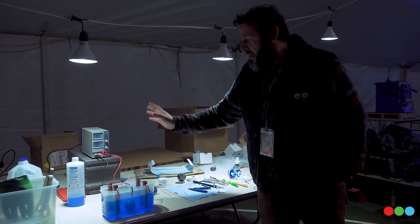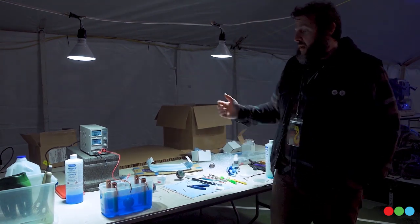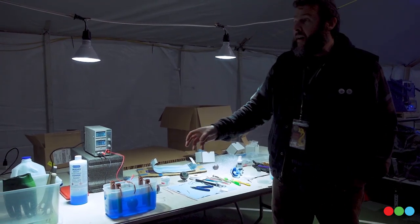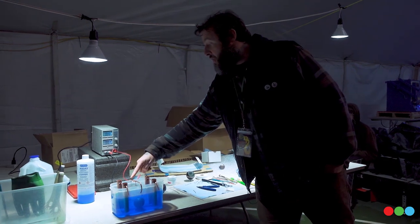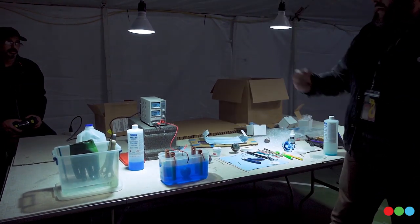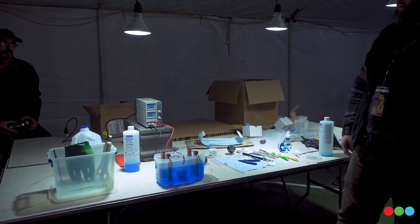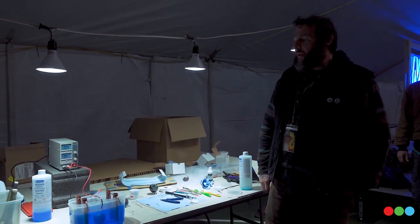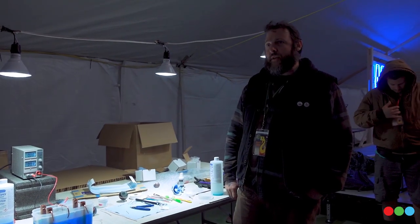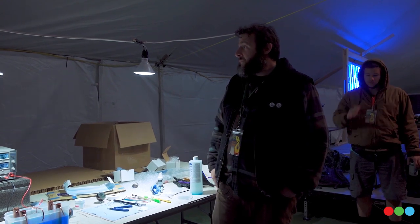So I would turn it all off. I would clean off those bars. I would filter my solution, and then I would put it back in there. Or maybe make sure where the banana clips are making contact, clean that up. And then I would turn it on and discover, oh, it's back down again and not making me be that aggressive. So that was a big turning point when I put those pieces together and was like, oh, this is telling me when I need to clean my solution.